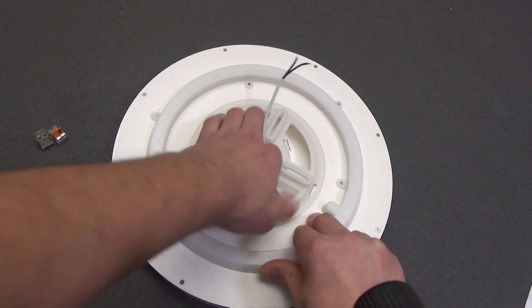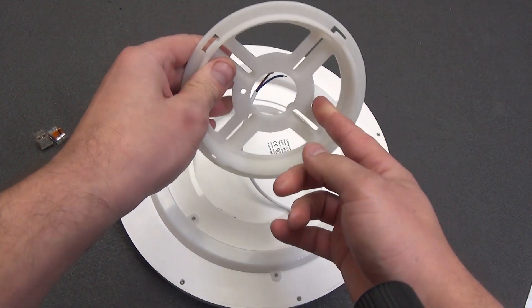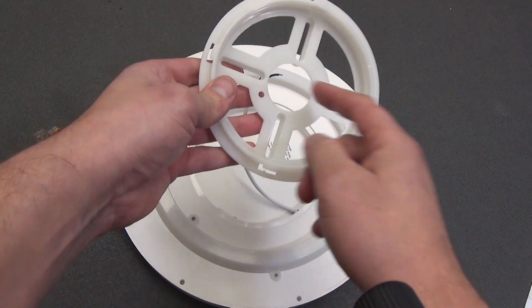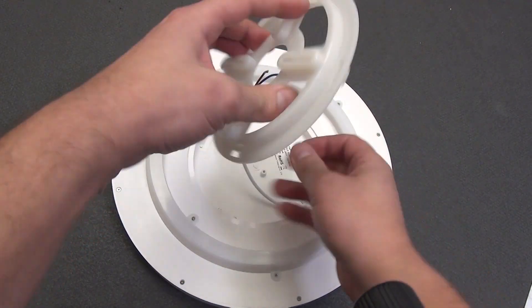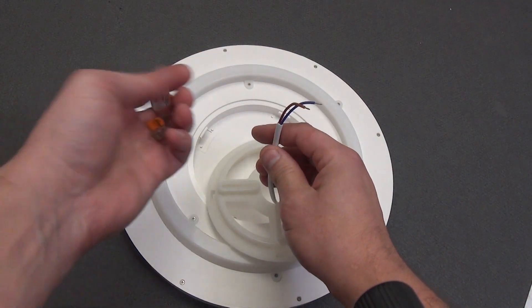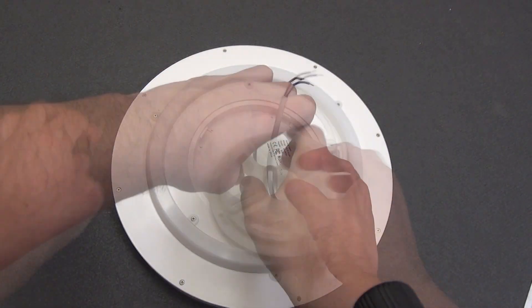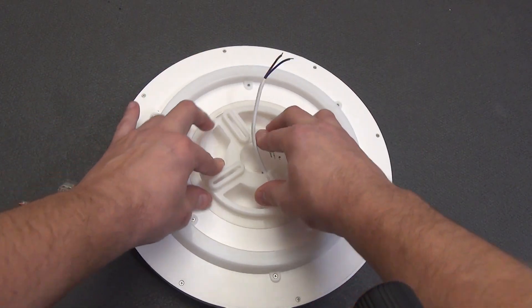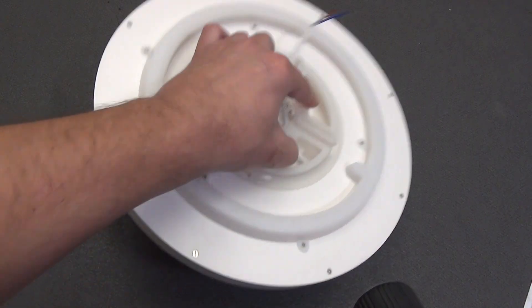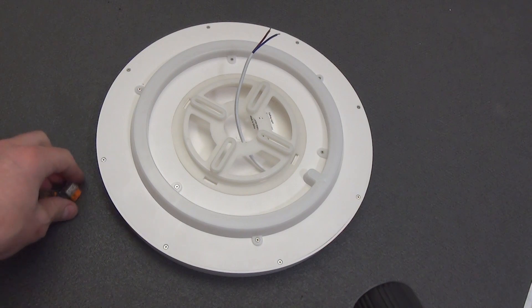In the central part there is a plastic ring for attaching the lamp. Unscrew this element, then using the screws included in the kit, attach this ring to the desired place on the ceiling. Now all we need is to connect the lamp power using the connector from the kit or using terminal blocks, whichever is more convenient. Then simply insert the lamp into the grooves and turn it around until it locks. That's all there is to the installation — anyone who has ever held a screwdriver can handle it.